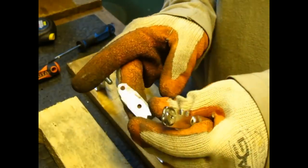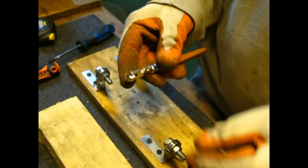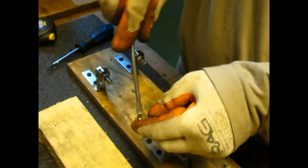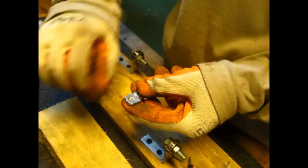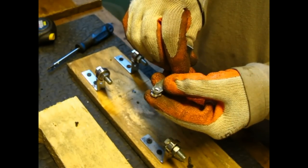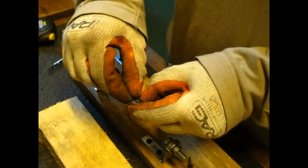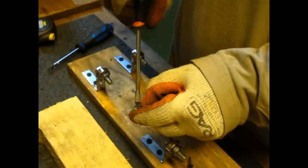So the glass cutting diamond goes on the last bracket, and as you see, I've ground the head quite a bit. I will show you a picture comparing it to the other three brackets later on. So this part is very easy also. You just use the flat blade screwdriver, take the diamonds off and put it on the bracket that you've ground out. You just need to make sure you grind out enough so the blades get exposed.